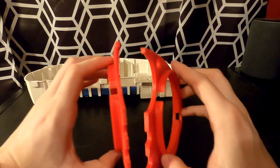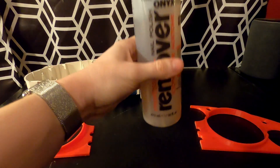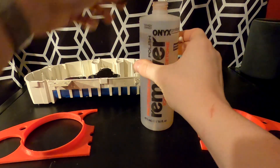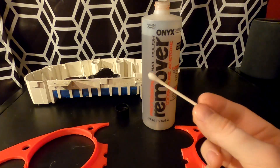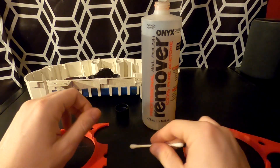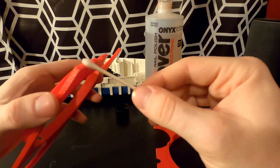I did sand the surfaces where they're going to mate up. Something that's really good for adhering ABS plastic — which is what I printed this with — is acetone, usually sold as nail polish remover. Q-tips work really well for applying it. You want to make sure the surfaces are nice and sanded flat on both sides. I should also make sure the acetone won't damage the desk — I'd hate to glue it to the desk. It's not making the desk tacky, so I should be good. This is high density polyethylene, which acetone will not attack.